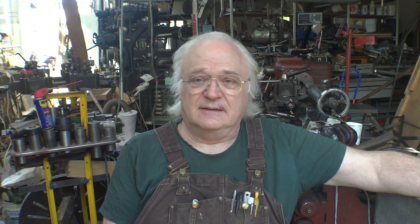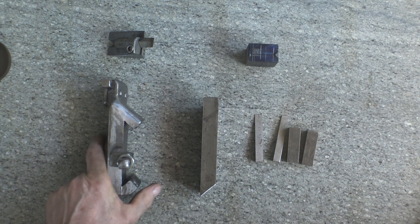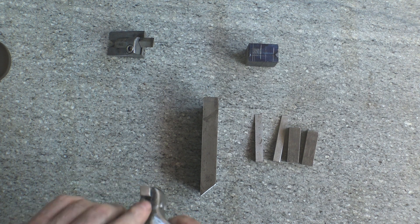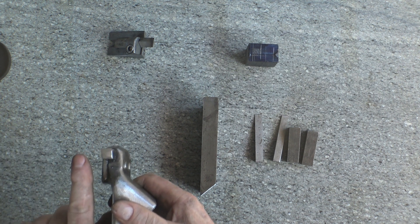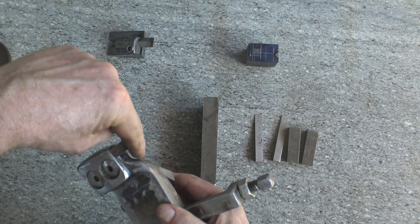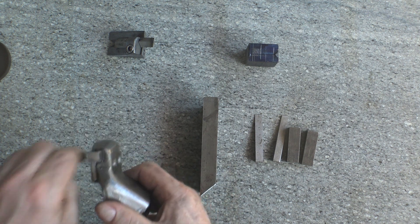So I'm going to go through the process of making a tangential tool holder. This is my right hand cutting tangential tool holder. The reason why it's called tangential, or diamond, is because of the diamond shape at the top of the tool — instead of the tool coming in at right angles to the work, it's at a tangent. All that one needs to do to sharpen it is to sharpen that surface flat. The rest of the tool geometry comes from the angle that the tool is situated at in the holder.